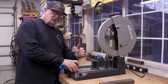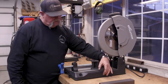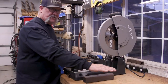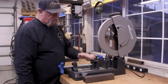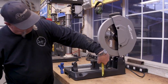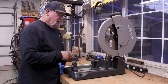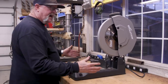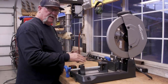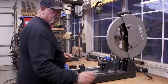Here I am over at the workstation I have set up for my cutoff saw. What I had before was the bed of the slugger was only two inches off my workbench, and that worked out good — a piece of two-inch square tubing on both sides let me lay the material in and keep everything nice and flat. However, this one is two and three-eighths of an inch. I've got to build something that's going to work on this station and keep the material nice and flat. This is really the area I have — you guys might have something different — but this is where this saw lives, where it stays, where I do all my cutting. So let's see what we can make that's going to work for my situation.